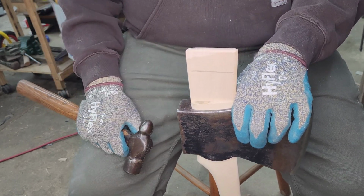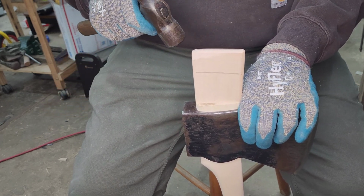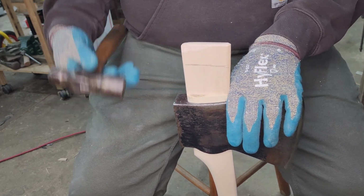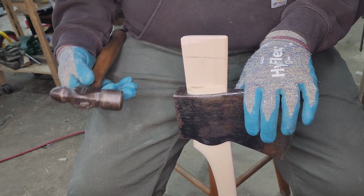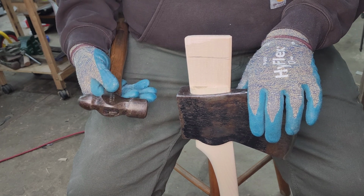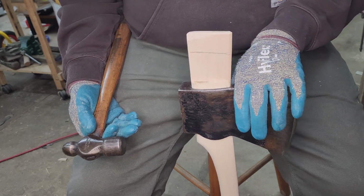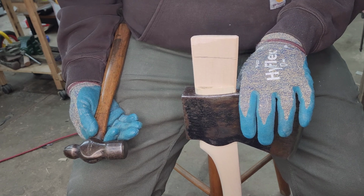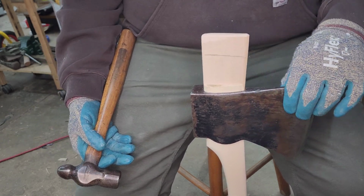Well, if you're holding the axe by the handle and then you're driving that wedge in, you're doing the opposite of what you did to just drive it, right? So, in my mind, you run the risk of the head jumping up the handle a little bit if you're doing that. Is it low because you're starting to wedge it? Yeah, the risk is pretty low, but in my mind, try to mitigate all the risks as much as possible when you're hanging it, you know?